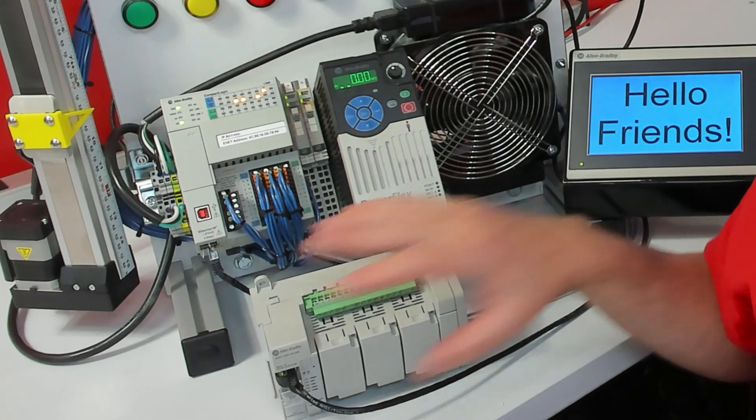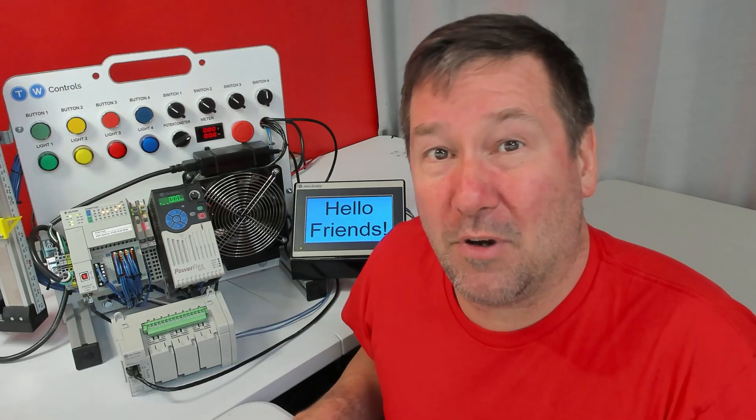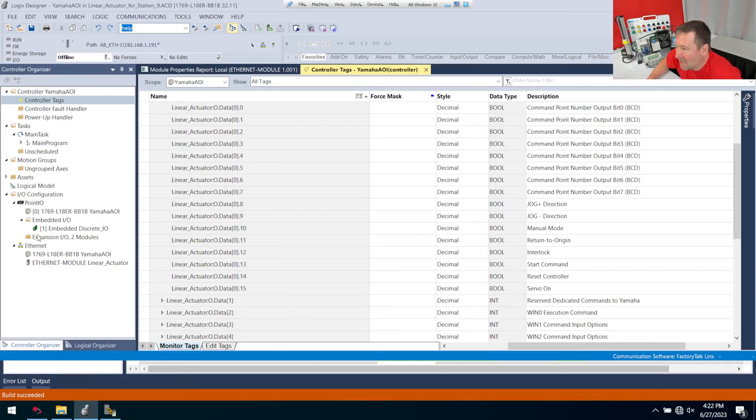I've been playing with this Micro 850e PLC, and this is the first time I've got to play with it. The big thing that makes it different than the typical Micro 820s and Micro 850s is that it can do Class 1 Ethernet I/O messaging. In layman's terms, what that Class 1 messaging means is that in Studio 5000, we can have Ethernet devices in our I/O configuration here. We've never been able to do that in Connected Components Workbench. But with the Micro 850e and the Micro 870e, we can do the PowerFlex 525s, the PowerFlex 523s with the Ethernet adapter, and we can do generic Ethernet modules. And that's the game changer.